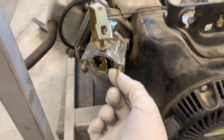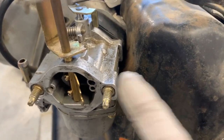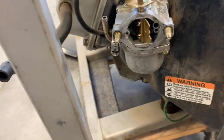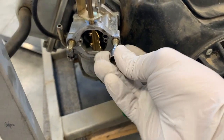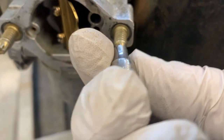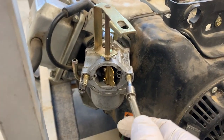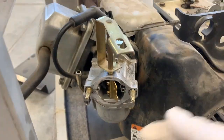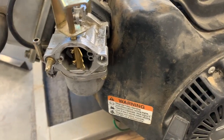Just like I thought, these two studs have to come out — they're actually screws that hold it together. You see how it's got a flat spot right there? That's the head of the screw anchoring it to the engine. If you use a four-millimeter hex driver — even though it's a torx drive on the end — in this particular case it'll come right off of there. Just like that. Times two.